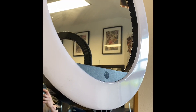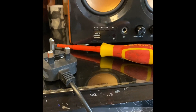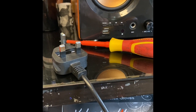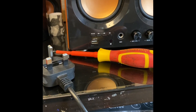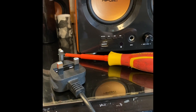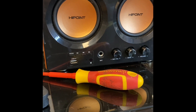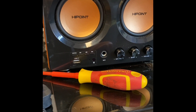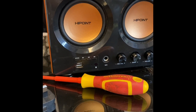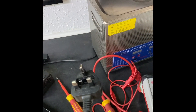So we've already tested the ring light up here and it all checks out okay, as does the extension lead, so I don't think there's anything wrong with the appliance. We'll run a test in a minute, but obviously we're going to have to put a new fuse in it. Sometimes a wrong rating or counterfeit fuse also points towards the item probably being substandard, but all seems okay here. We'll run an insulation test anyway and see what we get.